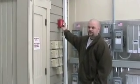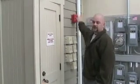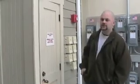Inside the units, there will obviously be a loud noise and a strobe coming off your building to indicate that there's water flow in the building, or an alarm due to a heat detector going off. I will show you what the heat detectors look like. If a heat detector goes off, this bell won't ring, because that's only for the flow of water. Correct. It's the strobe light that will indicate that a heat detector has activated. And the fire department has been notified that that heat detector has gone off and is probably en route.